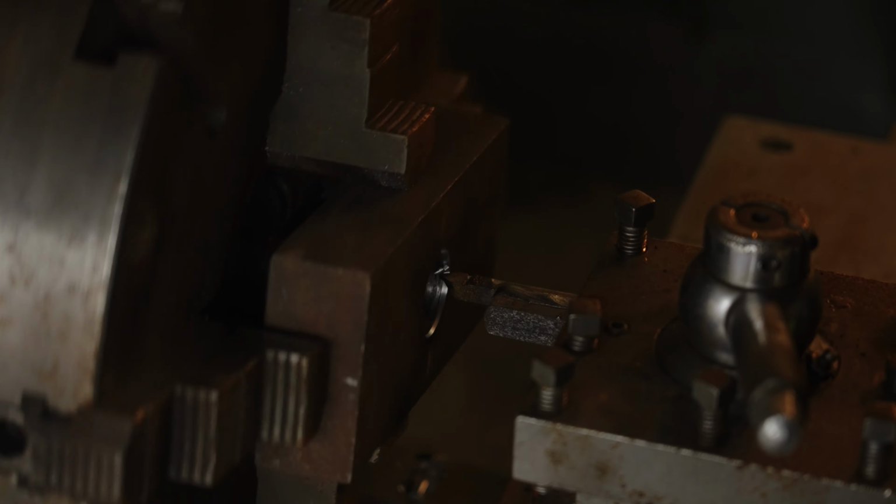Right, it's a bit cold. We've decided not to use that bit of forklift fork. We're going to use this, which is the original bottom plate that holds the die in. But we still need to drill a hole for that pin that goes in it. To do that, last time we used the lathe. But it's so cold and miserable, and I can't be bothered changing the chuck. So we're going to just go to Michael's and drill out with a proper drill.